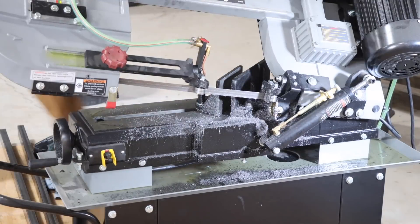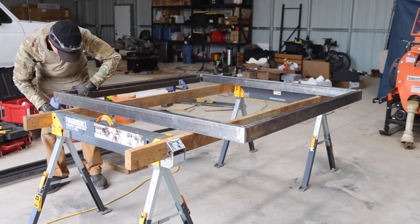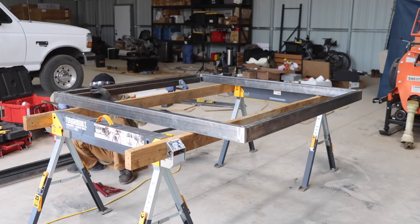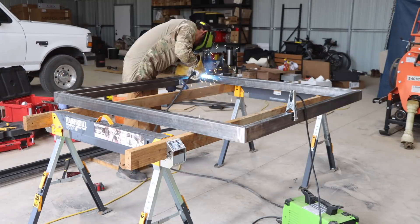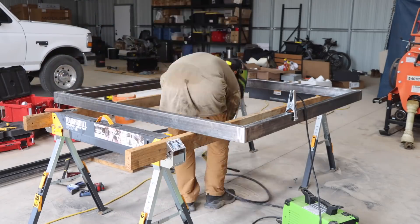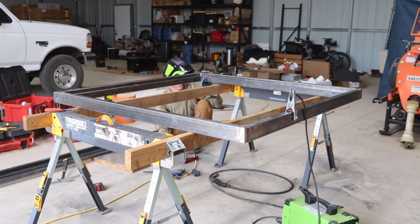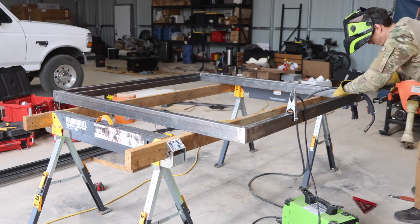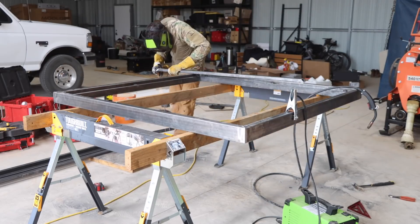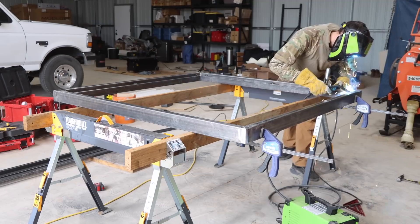The platform we're making here is a five-by-five square made with one-eighth inch rectangular tubing — I believe it was three inches tall by one and a half inches wide, so three by one and a half. There are lots of interesting dimensions you can get with the types of steel available. I buy a lot of my metal at Industrial Metal Supply — they've got lots of things that are already prefabricated, like gussets, and they've just got a lot of cool stuff in there.